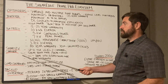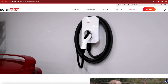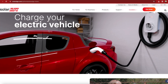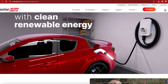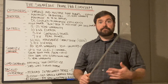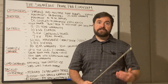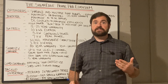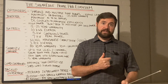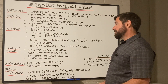Next, they've got a smart EV charger that can go up to a 40-amp level 2 charger. When connected to the grid and solar, you can program it for solar boost mode. You can also set it to only charge from solar with the excess solar mode — so if you're at home during the day with your car plugged in, you can program that EV charger to only charge your EV once the solar meets the home's demand. Any excess solar will get sent to your EV rather than being exported to the grid. That smart EV charger comes with a five-year warranty.